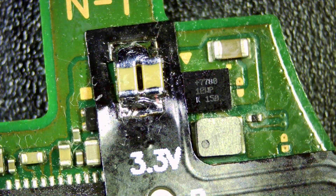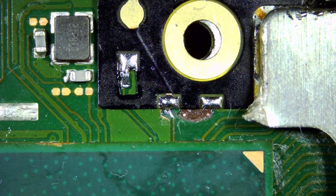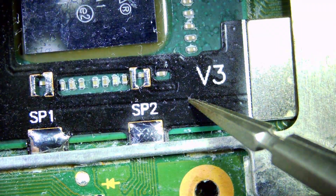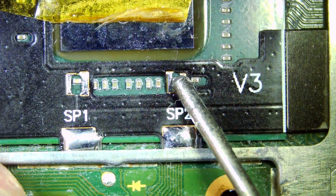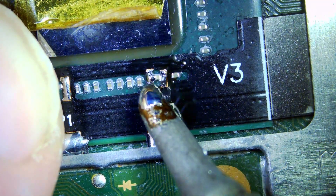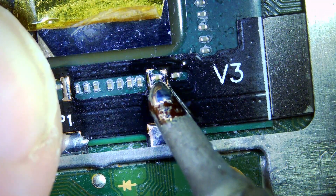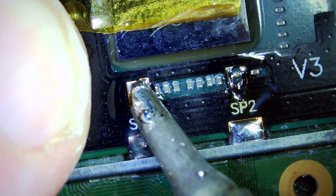Once it's clean and dry, give it another once-over to make sure all solder joints look complete and strong. Then insert this next bit — line it up so it goes over the two chips you're going to solder to, making sure the two on the side are aligned. Put a little bit of Kapton tape to hold it in place, add a little flux, then plenty of solder — keep moving, don't hold it on too long or you risk lifting the caps. When you're happy with a solid solder joint, move on to the next one, again with plenty of flux and solder.